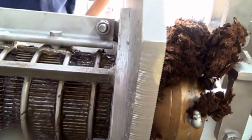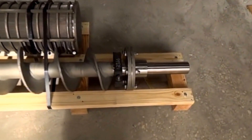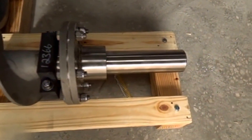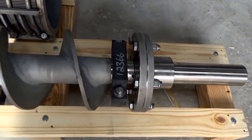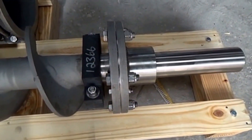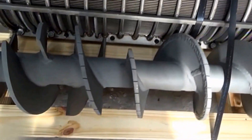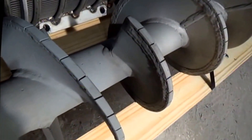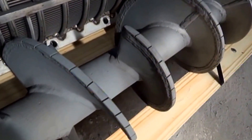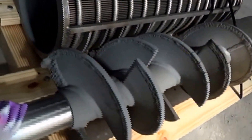Those waves are because of the screws going around. Over in the shipping department, here's an interesting thing — the shaft on the right goes inside the gearbox. We've got a fixed flange there to make this into a two-piece screen, a seal box with a seal in it, a black plastic feeder section with a screw, and one, two, three stages of compression. We've got notches in the screw — they fill up with fiber and act as a brush to wipe the screen. The hard surfacing material is there because that's where you have abrasion; you need abrasion resistance.